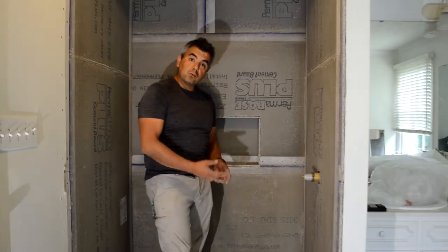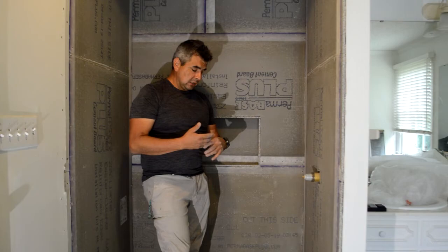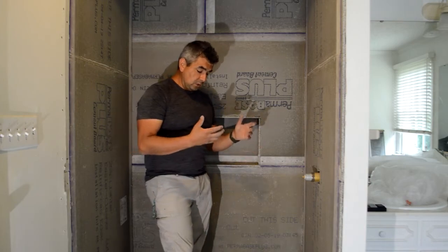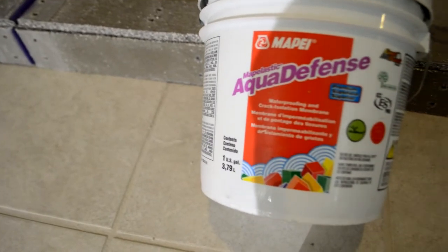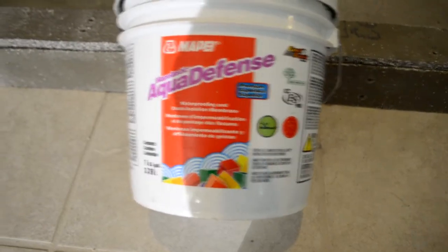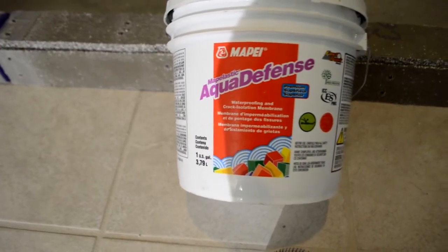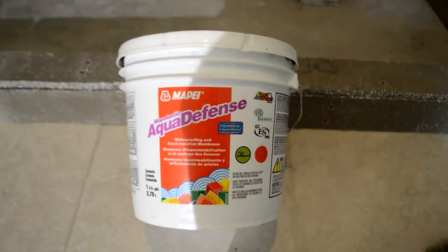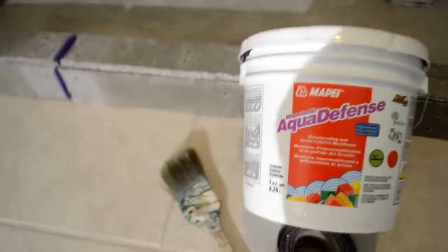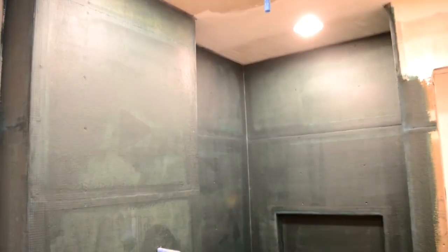Now they sell this waterproofing membrane. It's like a liquid plastic that once it's nice and dry, it becomes hard like plastic. So that gives you an extra waterproofing possibility there. So water, if it seeps through a corner or something, it will be contained there. So that's a really practical thing because you can work with that in many ways, right? So you apply the stuff and then you continue working with your concrete walls now prepared for tiling, right?